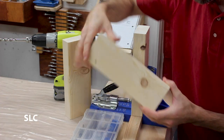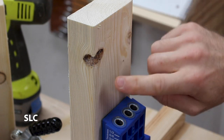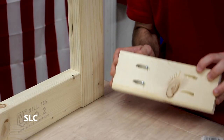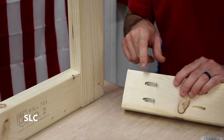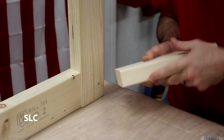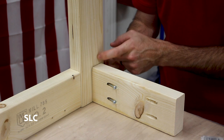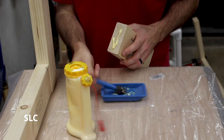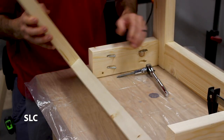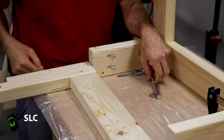I'm going to take the 10 inch boards and put pocket screws on each end. If you happen to have any major imperfections — like I had a knot right here — just make sure it's on a side that won't be seen. I'm going to be attaching those 10 inch pieces to the legs we just glued together using glue and pocket screws just to hold them together initially. Since pocket screws come in at an angle I'm going to come in about a half inch and give it a little more bite to the wood. For the opposite side I don't have room for the drill to fit in, so I'm actually going to use a ratchet with the tool and we've got all the screws in.